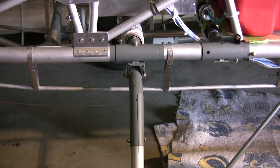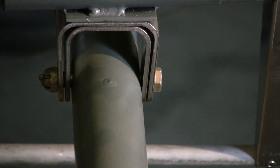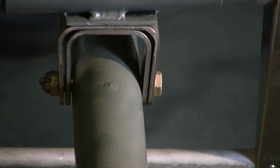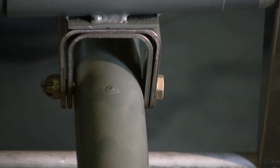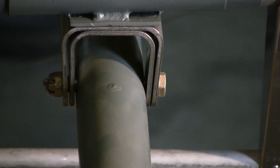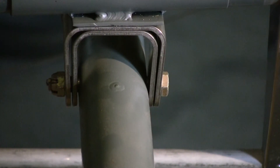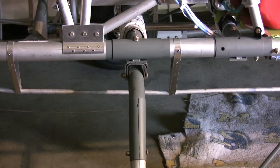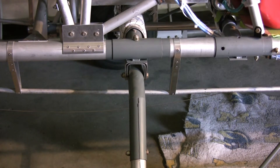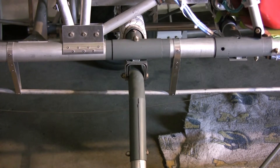So I'm going to have to pull the gear off and change that bolt out. What I can do is use what I call a blank bolt — it's a bolt that I've ground down the end of to make a bullet shape. I can take that nut off the back side, drive that bolt out with the bullet bolt, and then put the correct bolt back in there.